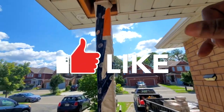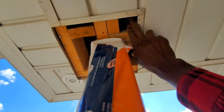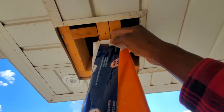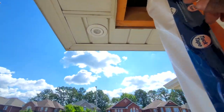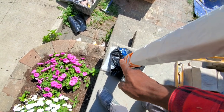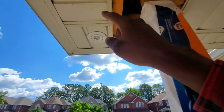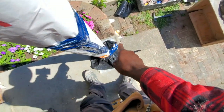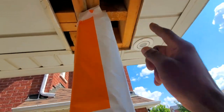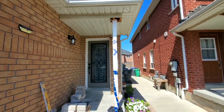As you can see, I used super 6 underneath the plate with some plastic for extra support, and also the Tyvek with all seams taped. We secured it up top nicely into the joists which run right across. We took the measurement from the edge to our post at the bottom, matched the same measurement up top — our post is perfectly plumb. Now we're going to start to install some stone.